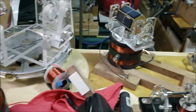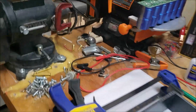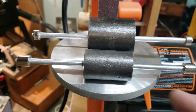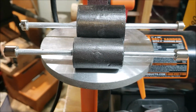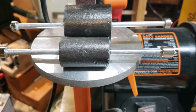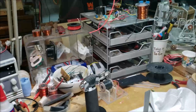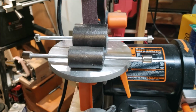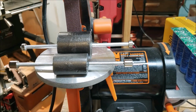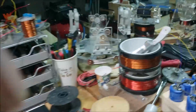Just a lot of stuff. The first circuit I'm going to try on this is that one with the four-legged Hall effect sensor. I want to see how well it works on that without it heating up the sensor, because when I tried it on some of the bigger motors, it heated up the sensor big time. So I think if I use thin wire and a lot of it on a spool, I'll negate that problem. And I also got myself a whole bunch of these spools.